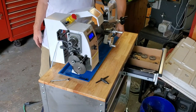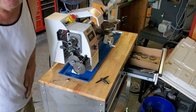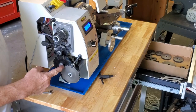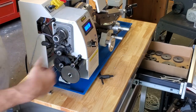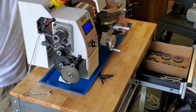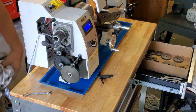I think I'm going to put a couple of plastic gears in to eliminate the noise. We got a plastic gear off of Grizzly — they come with a three millimeter keyway and we had to broach it out to four millimeter to fit it. We put that one in between the metal gears to try to improve the noise, and that's way better — engaged, key engaged, disengaged. The lead screw is way better.